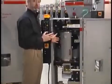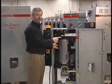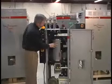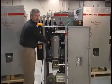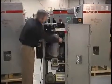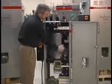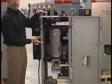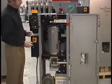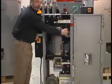Typically it takes about 20 minutes to get that amount of material up to the appropriate temperature. After 20 minutes, the unit automatically indexes, so the hot material comes back to the rear left corner, and we start the first stage again by filling and heating that material. In the second stage, we seal the canister top and bottom, and we draw a vacuum. Again, after 20 minutes, we have another canister full of hot material.